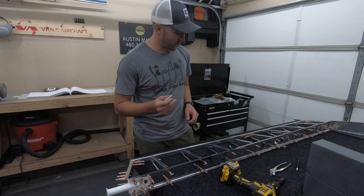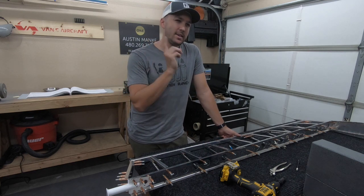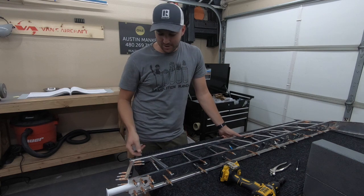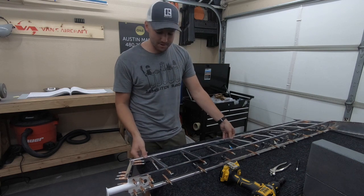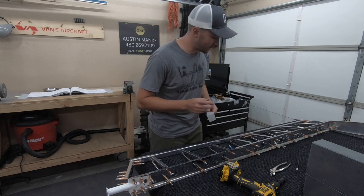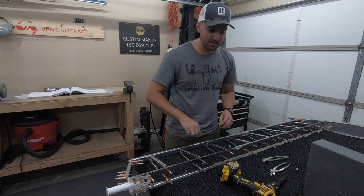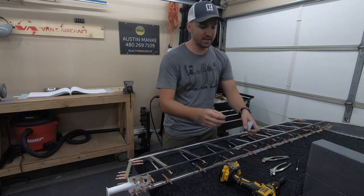And that is, when it comes to countersinking this, I learned, I forget which one we were countersinking previously, that it's easier to do it when it's kind of held rigid for you, so I'm leaving this assembly together while I'm doing it. But one thing that helps is, because when you're countersinking this material, it's so thin that it's easy for the bit to lose its pilot.